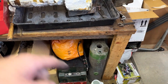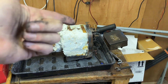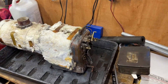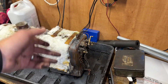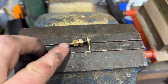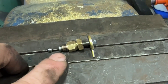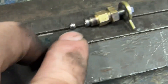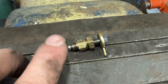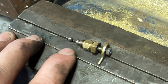I've just drained all the water out, and it's occurred to me I should have left it full so that when I've sorted this valve out I can try it again — but never mind. I will take it apart, take a look at it, put it back together, then fill it back up again. So this is what's come out: the spindle has a concave sink in the end and pushes on a ball.